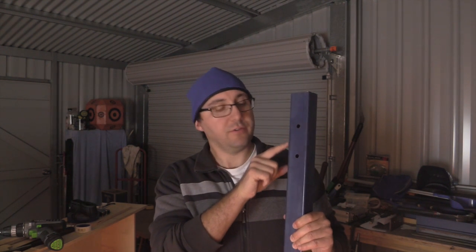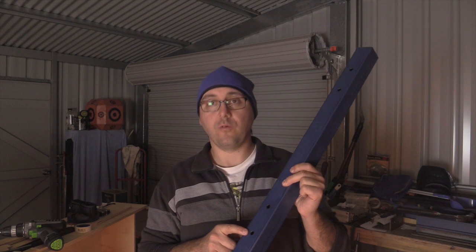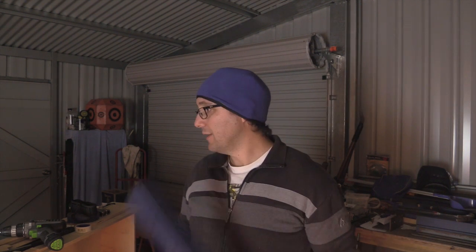Okay, so here's the first one done. This is the top, so we've got two holes: one at three and a half inches, the other at six and a half inches, and then two more down at twenty-one and a half inches and twenty-four and a half inches. Because we work metric over here — my tape measure does — I do have a metric and imperial tape measure, but it reads out in foot-inches. So I've actually taken the Sharpie and written on the tape all the way up to sixty inches, because I got sick and tired of trying to work out what's two foot three inches. The Sharpie's made it a lot easier. So that's the first leg done.